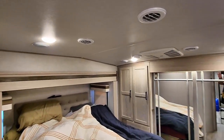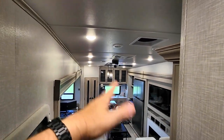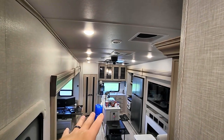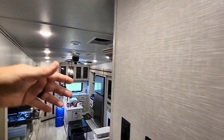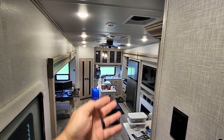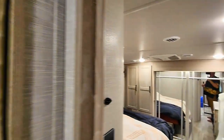The benefit is I don't have to hear the noise of the bedroom unit. You can also do the exact opposite: late at night, set the living area unit on automatic to shut off when the room reaches, say, 75 degrees, and keep the bedroom unit set on 70. The bedroom unit runs, keeping things cool through the duct work all through the RV. If the living area gets above 75, that unit kicks on, cools to 75, then shuts off, while the bedroom unit usually maintains that temperature.